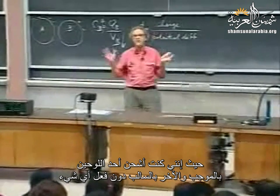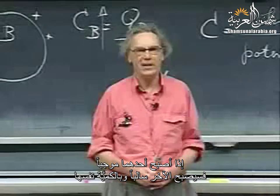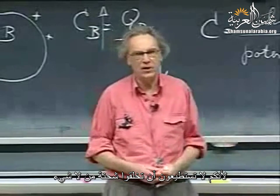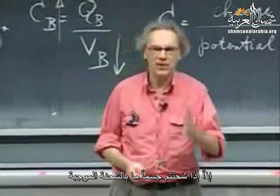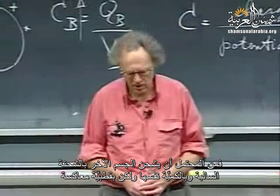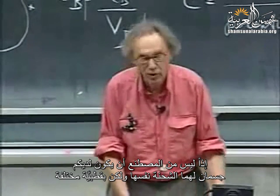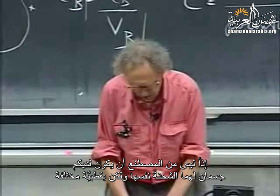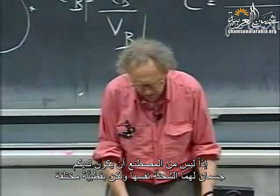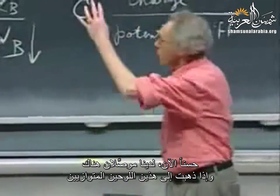And without my doing anything, if one becomes positive, the other one becomes negative by exactly the same amount, because you cannot create charge out of nothing. So if you charge one thing positive, chances are that something else is charged negative by the same amount, but with opposite polarity. So it's not so artificial that you have two conductors with the same charge but opposite polarities. So now we have two conductors there.